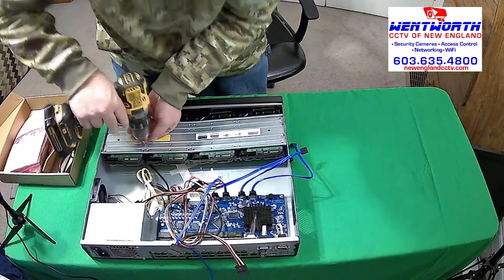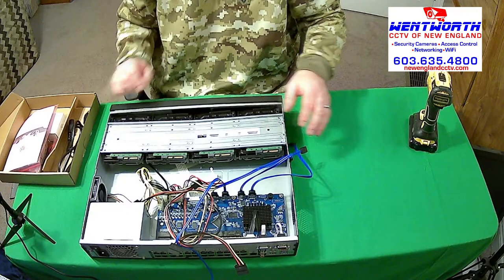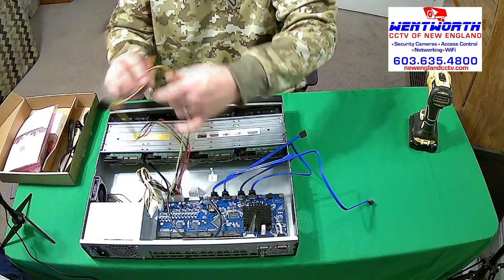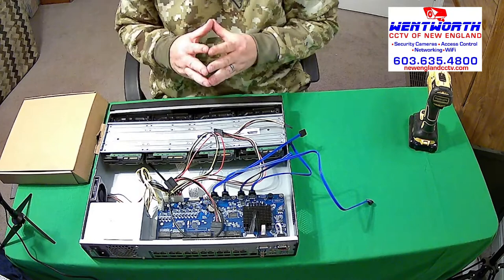Okay, so those are all mounted securely now. We've got all the screws in, so when it's running, there's not going to be a lot of rattling and noise. Now we want to deal with these SATA cables. If your machine does not have these, which it should, either in the NVR when you remove the cover, or in your hardware box. If you do not have cables, there is a link below for these NVR SATA cables.